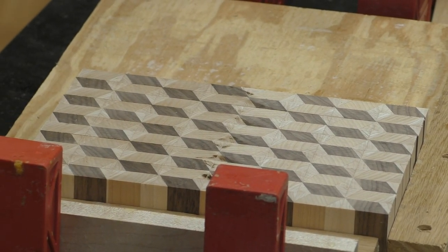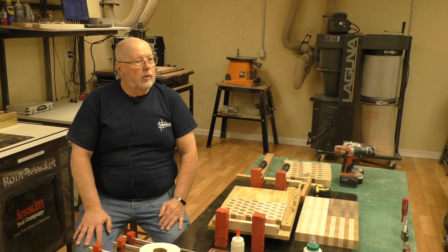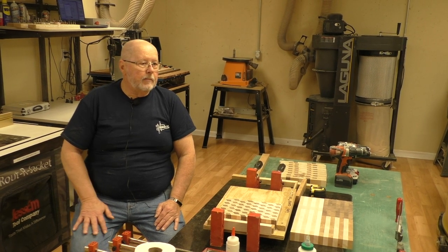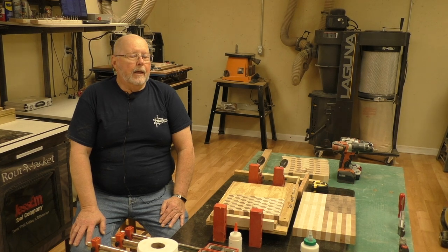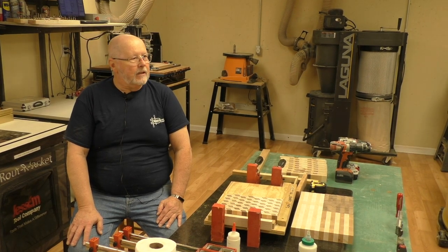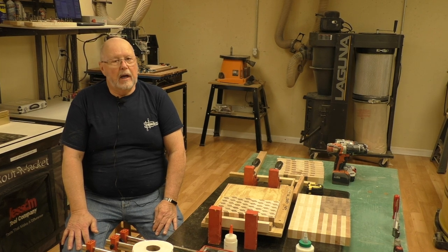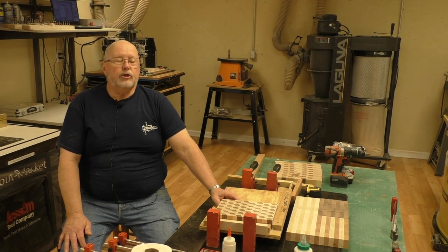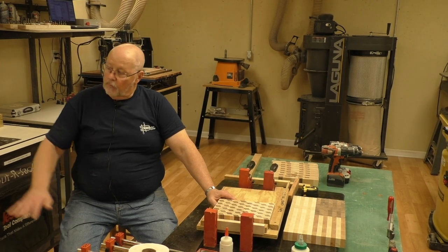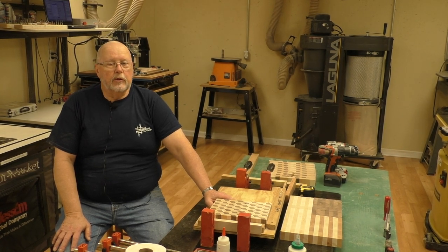There is the 3D cheese board. Once it's glued up, you need to either run it through a planer with sacrificial boards or run it through a drum sander. I prefer the drum sander. On all of these cutting boards, I start with 120 grit on the drum sander. I've had extremely good luck using FinTech zirconium oxide abrasives on my belts. Then I change to 150 grit through the drum sander, then come over to the bench and use a random orbital up to 220. I usually don't go more than 220 on any of them.